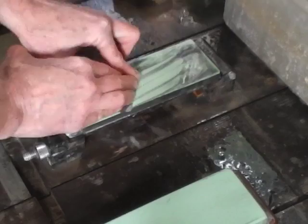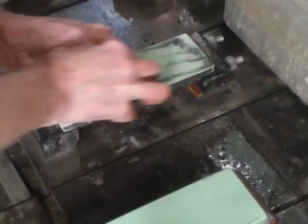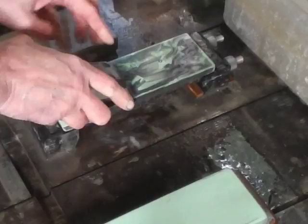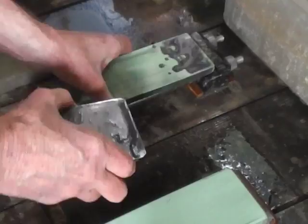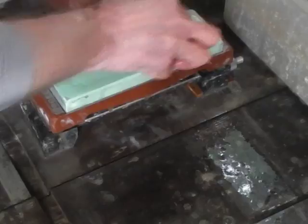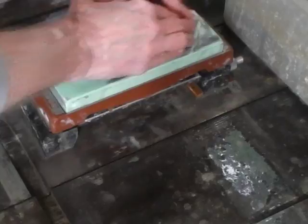You could do three or four minutes on a lot of these stones instead of just the 20 seconds I'm doing — this is just to get you started. Some people do side sharpening; I don't. I like straight-on sharpening also for the final passes. You may have an 8k, 10k, or whatever — this is a 16k or 15k. If you only have the Tomae, you'll want to work up through 8 or 10k, maybe 16 — you don't necessarily need to because the Tomae is going to do a lot of this work by itself.